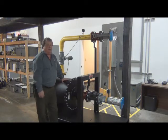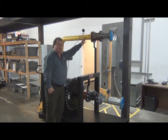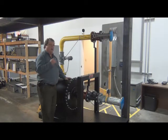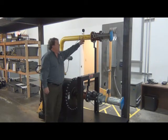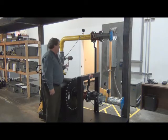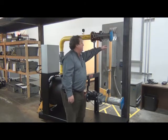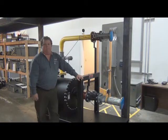This package has what we call our Mode R flow controls, which utilize a Siemens SKP25 gas regulator, where we're sensing gas pressure downstream and actually controlling the booster — turning it on and off based on load in the building. Coming out of that we sweep across. We have another gauge for monitoring the performance of the gas booster and setting the pressure of this regulator. Again, an outlet lubricated plug cock and another stainless steel flex hose for connection to the building piping.